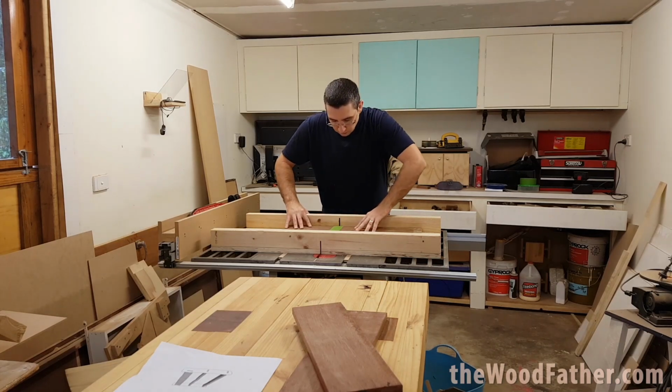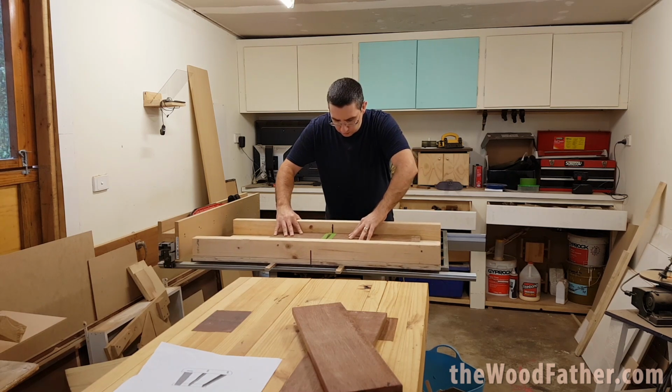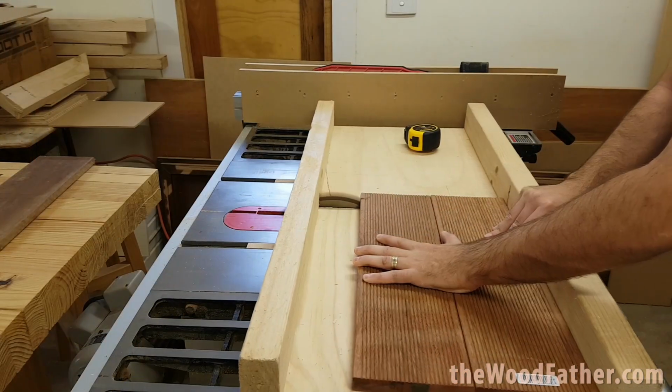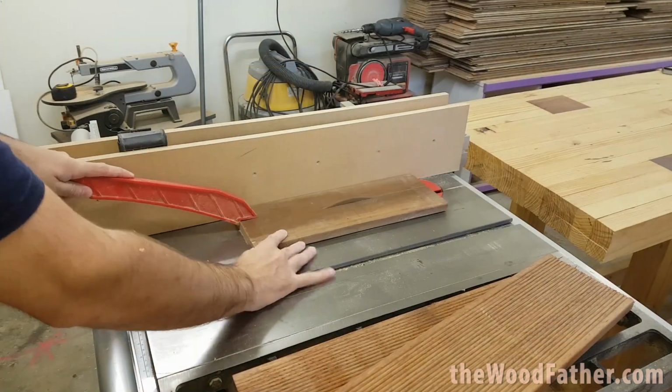The rack is very simple to make. It's only 5 boards and it's mainly held together with half laps and a lot of glue, so anyone can build this one. I made this one pretty much entirely on the table saw, I think. A little bit of sanding, and that is probably the only power tools that I use.